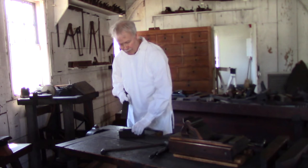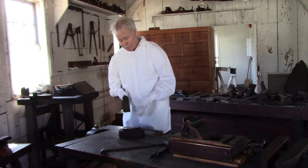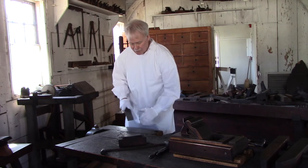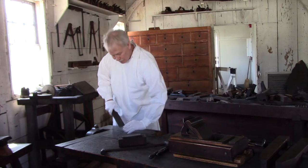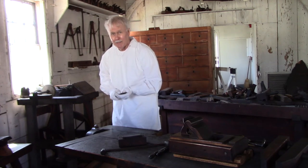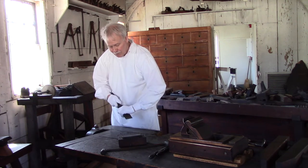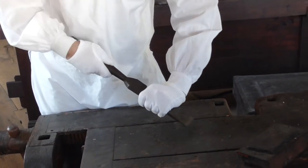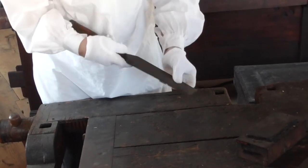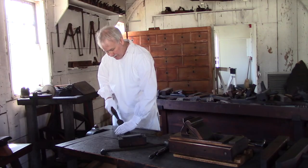This would normally conclude what I'd say about wood chisels, but I find myself compelled to tell you the wood chisel is the most dangerous hand tool in a hand tool shop. The most common mistake is that somebody thinks they can hold the piece of wood they're going to work with in one hand, trying to push with the chisel with the other. These are supposed to be razor sharp, and that's how people get hurt. The way you hold a chisel — always, if you're right-handed, put your left hand on top of the chisel, right hand back here — you can push, you can control it. And notice the bevel is down. The reason for that is I can control the depth. That's no mistake, the way I have the bevel.